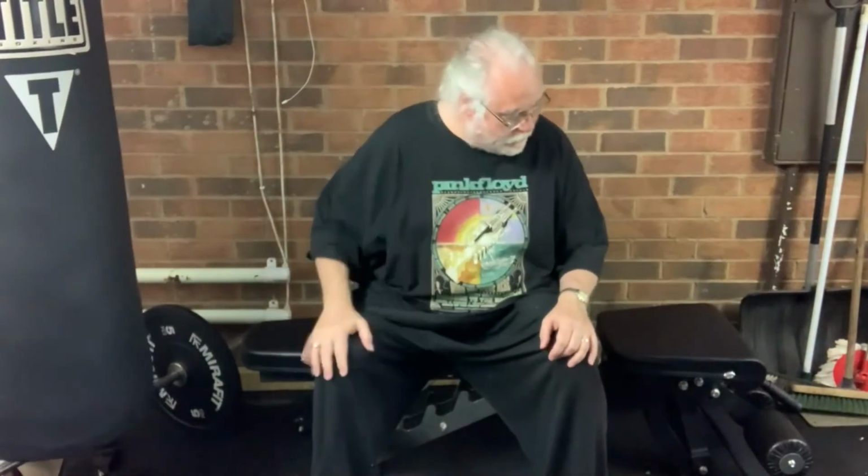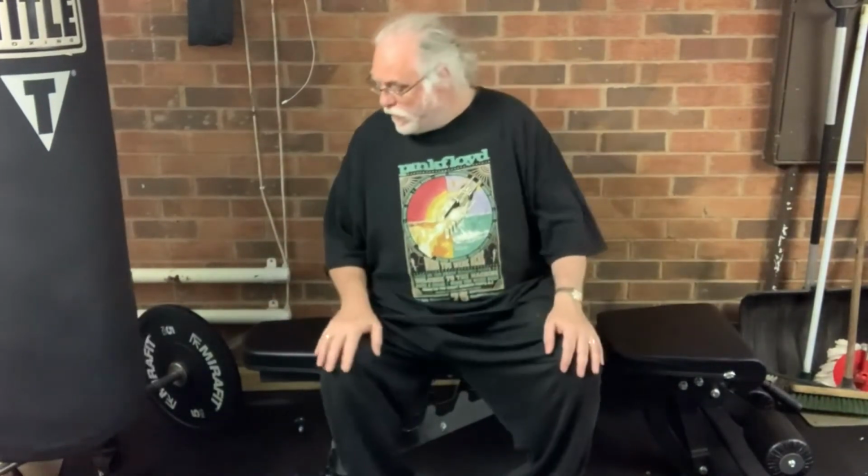The other thing was, as I pointed out, one of the holes in the kind of ladder frame for holding the seat at the different angles wasn't drilled right through properly. There was just a tiny little bit of metal left there. I couldn't get my hands on a file, but I just managed to knock it out with a cold chisel and a hammer. So that was also resolved. And here we are. We have the final assembled thing.